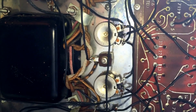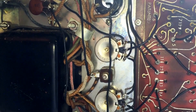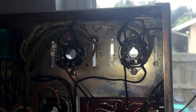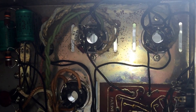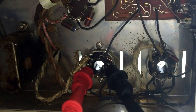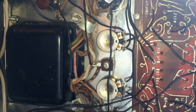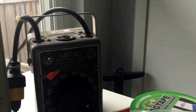Ultimately what we're going to do is, without the rectifier tube — because I don't want to work with any high voltage DC at this point — put the EL34s in to load down the circuit, and ultimately see what kind of heater voltages we're getting on the EL34s at its proper voltage. For the purposes of this, I'm going to be measuring at 115 volts and see about any changes to get that to work correctly.